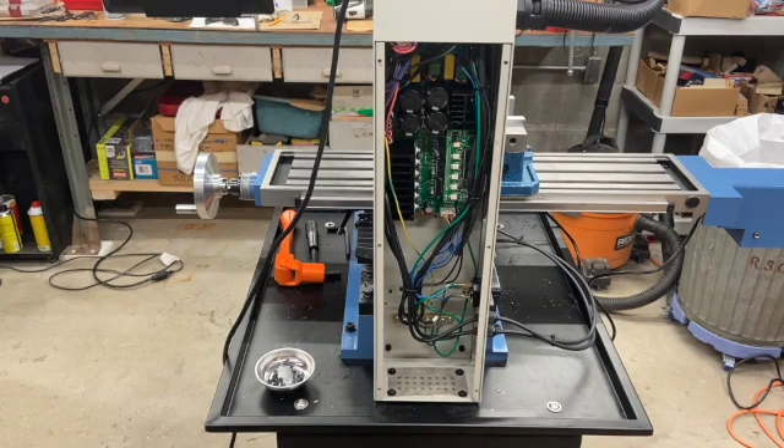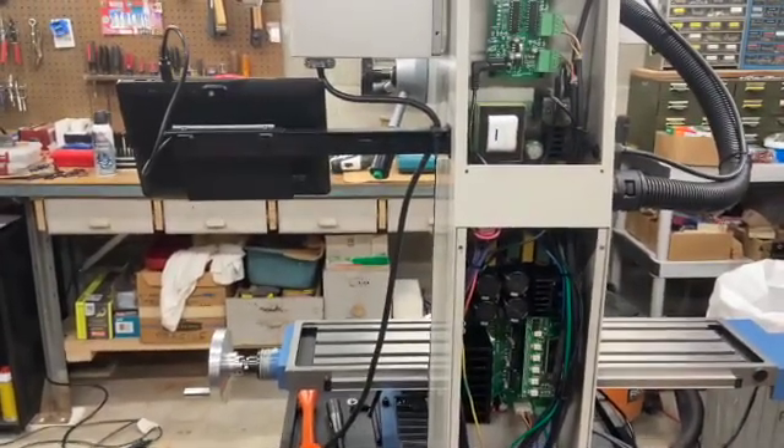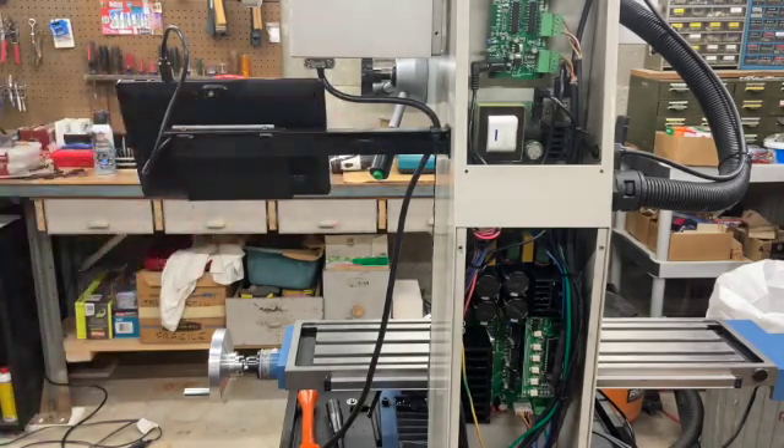While I was back there — my mill is the deluxe model, which came with a Bluetooth DRO with a slick little bracket to hold the tablet. It even has an electrical wire for charging, so they did a good job there. But I was checking the bracket and the mounting screws were loose. Those have screws with nuts on the inside, so you can't tighten them from the outside — you've got to get in with a wrench on one side and a screwdriver on the other. Just a general rule of thumb: as I go through things I check screws and bolts to make sure they're tight.